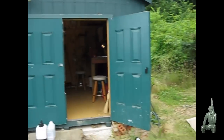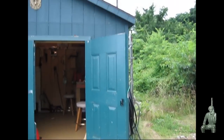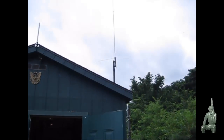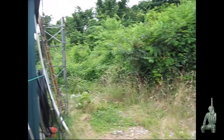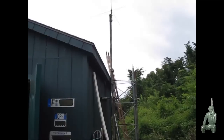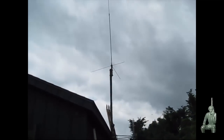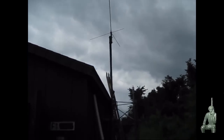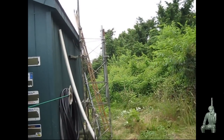So tonight we're going to try connecting the simplex repeater up to my base station, which is connected to the 6dB gain whip antenna. I've discussed the importance of having a good base station antenna. Handheld radios that you buy with that rubber antenna have absolutely no gain — in fact there's a loss — and that affects the performance of your radio. With an external base station antenna, you can hook that up to your radio and greatly improve its performance.